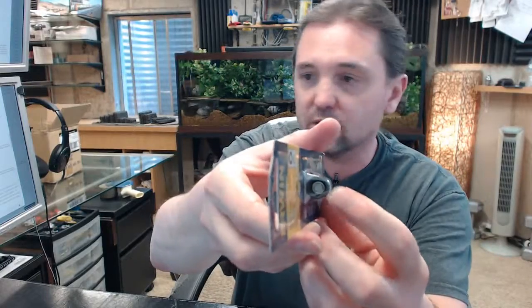That is obvious that you are going to be driving nuts with this. The lobular design is basically this: on the inside corners of the tool there is a relief cut at an odd angle. That lobular design allows the transfer of the rotational forces to be on the flat sides of the nut or screw head, rather than on those weak outside corners. I have personally used their lobular design and can tell you that it continues to work without damaging those outside corners after high volume applications. It is an improved design. It is a superior design.